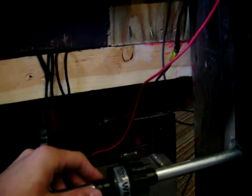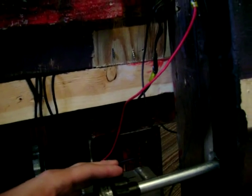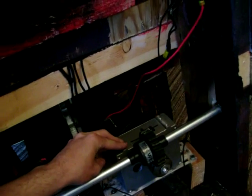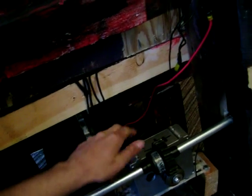The way this works is we got a 12-volt motor right here. This is the motor — it has a gearbox, which then comes down in here to a worm gear. The worm gear will cost you a pretty penny. These two, the worm gear and the worm, cost about $130. We got them from Motion Industries. You have to look around town for it — they won't sell them anywhere like Home Depot. I recommend going to some sort of industrial liquidators to look for a motor that you can hook up. The hard part is finding a motor and the gears.